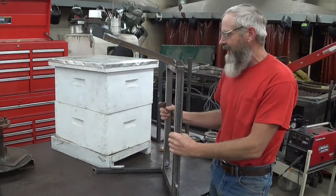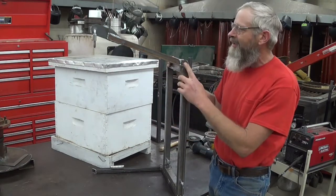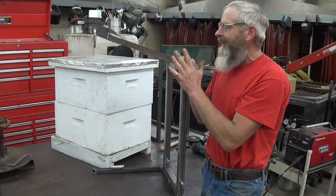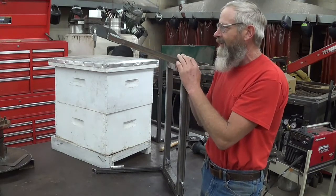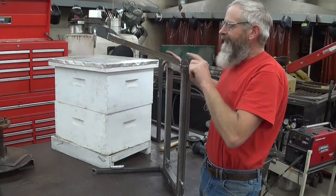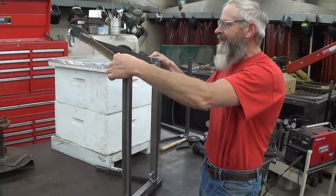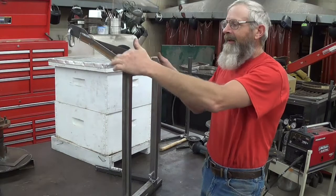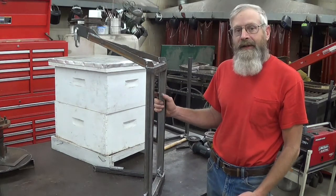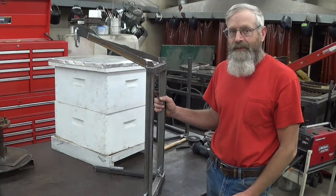I'm pretty excited about this — I think I've got it down pat. I know I kind of rushed through some things on measurements and that sort of stuff. I just cut these angle irons 16 inches long and then began to fabricate, kind of seat of the pants, to figure out what was going to happen. I welded these two here on first, then I cut V notches, spread them out to where they were the right width, welded the corners down, then V notched this and lifted it up to give it a little tip, and welded everything solid. That's going to be it for this video — I hope you enjoyed. If you have any questions or comments, please leave them in the comment section down below. Thanks for watching, and we'll catch you next time.